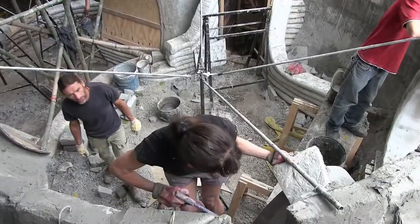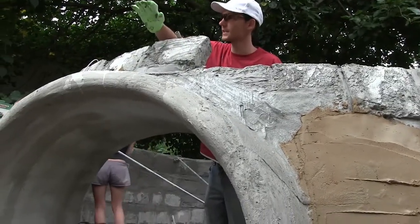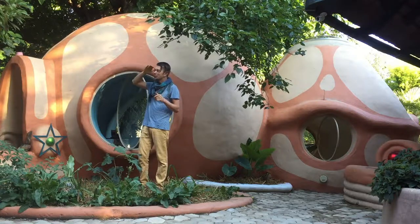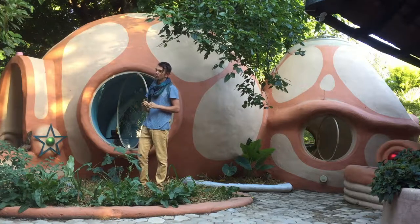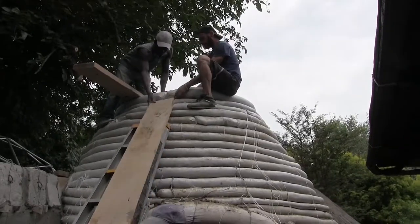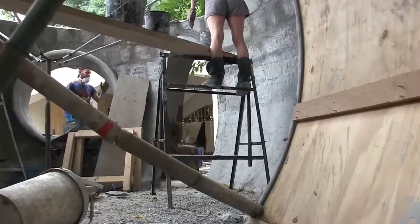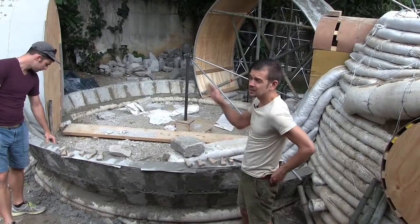I'm going to teach you how to build the foundation, how to create the bricks, how to stomp the sandbags, how to insert the windows, and how to build around the windows. There are some tricky eyebrow situations on the sandbag dome — we'll go with larger bags around the eyebrow and eave to create an awning which will stop water from coming into your window. As we get to the high levels it gets quite tricky, because the bricks have to be shaped and the sandbags stomped in very specific ways, as the core is curving in quite a bit.